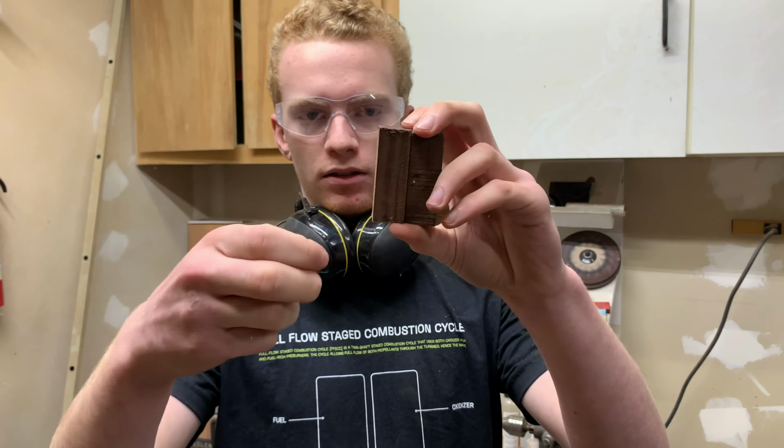Okay, so I've got the pen mandrel in the lathe, and I got these little bushings. These bushings tell me how thick to make the piece of wood. So basically I turn the edges down to this thickness, and there are different ones depending on what pen you're making. So you just take these, I brought it down to the brass tube. Usually I try and line them up so the grain matches. There you go, so you can see the grain matches there. Grain matches. So that one goes on. It goes one bushing in between.